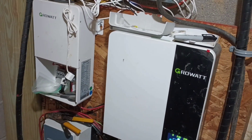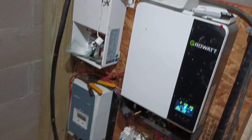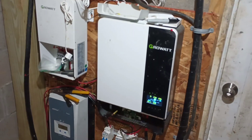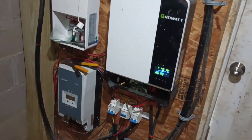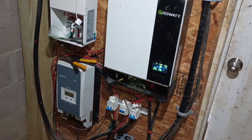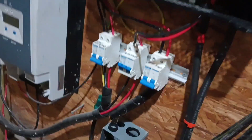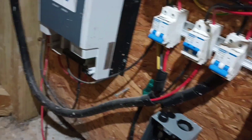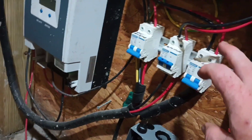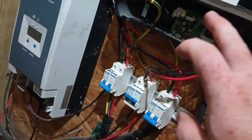This is allowing me to bring in my solar. I've got an array of solar panels mounted on a shed over here — I'm going to show that in a minute — but the solar power comes in to this basement through this red and black wire here, goes through this breaker, and up into the inverter.